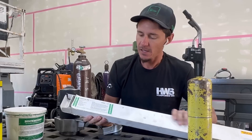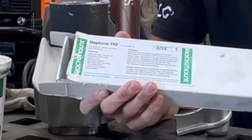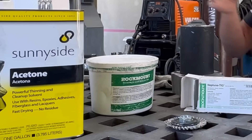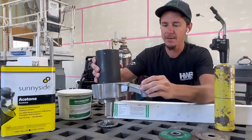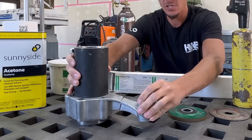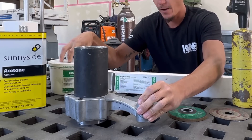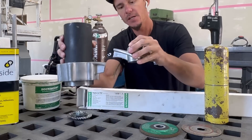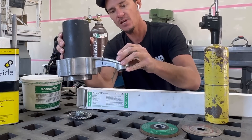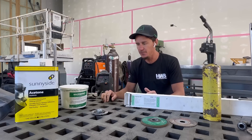Then I'll be using some Rock Mount Neptune TIG in 3/32nd. I like this stuff — it's specialty made for repairs. I have some flame hold here. Because this is an awkward spot, I'm going to need a way to hold it — it doesn't sit flush on the table and there's no way for me to clamp it. I might just put a little ball underneath this spot to hold it up and into place while I tack it. That's basically all the tools I'm going to have here on the table today to do this repair successfully.